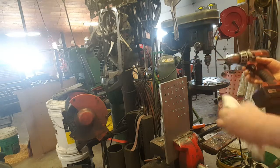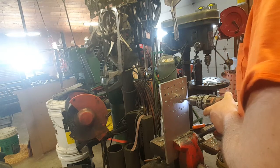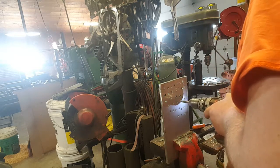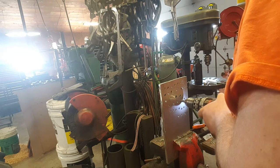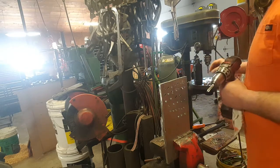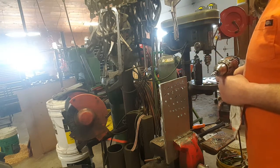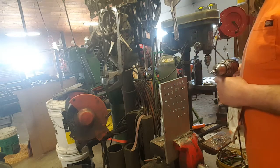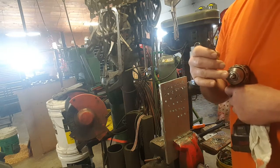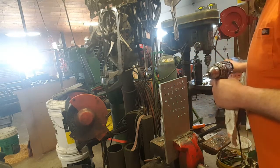And here is a machine shop quality one. I will start a new hole. And we are through that quick. I think that is, you know, $7. Yeah, just over $7, $6, and this other one was $2 or $3. So for $1 more, if it takes that much less torque to run through, what are the odds of breaking this tap shank versus this one out in the field or whatever, you know? So that's kind of important to me.